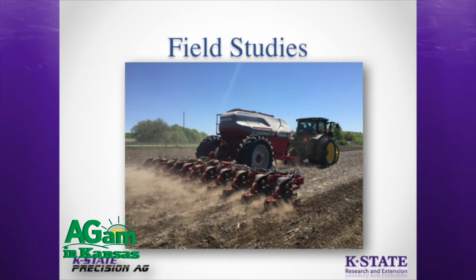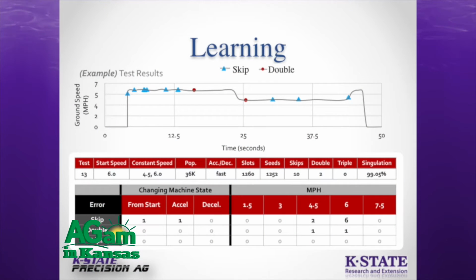But what we learned is that there is a threshold in terms of the seed plate RPM. So there is a combination of what speed you are planting and what population you are planting that decides the RPM of your meter. So after a certain threshold, you start to drop on your singulation aspect. So that was a pretty good learning from our perspective. And this is not true only for Horsch. This should be true for other planters coming from John Deere and Precision Planting technology, and CNH.